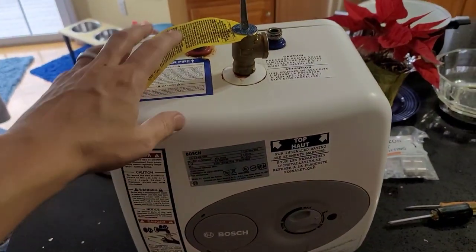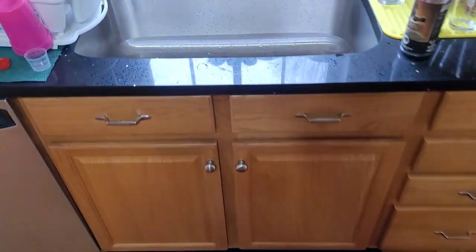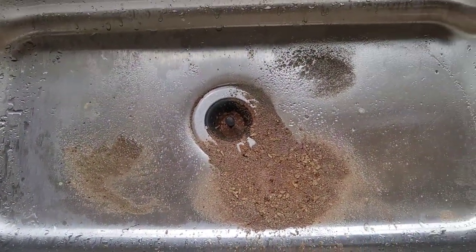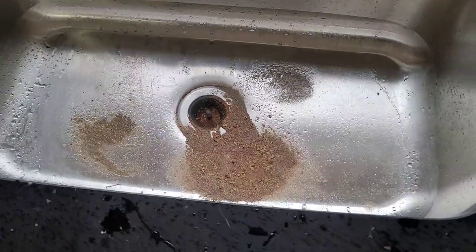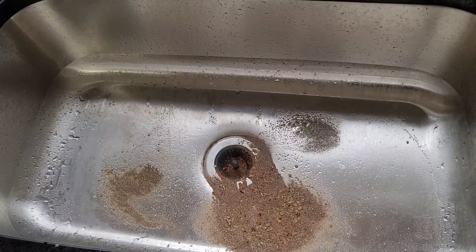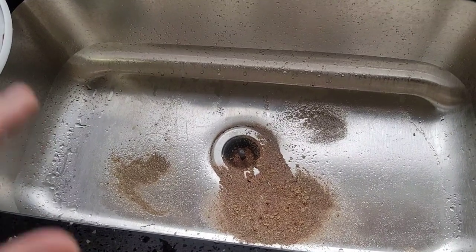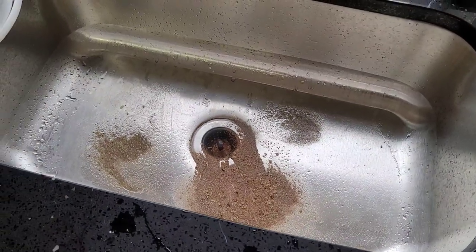I just got this on the table and the water's been drained out. You just flip it upside down, and I'm not really encouraged by what I found, because as this drained out, that's what was inside that tank. That's a good chance that's part of the anode rod, if not all of it. I know we've had water main breaks in our area over the nearly six year lifespan of this, so there's likely sediment, and also when we changed the hot water tank in the house there was likely sediment stirred up and gotten in here. But let's pull the heating element and see what it's like inside.